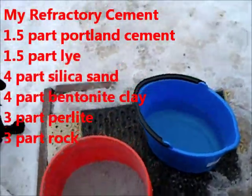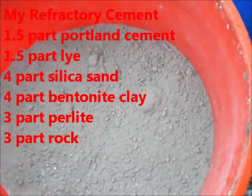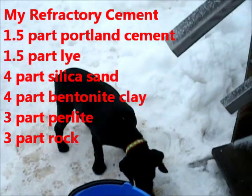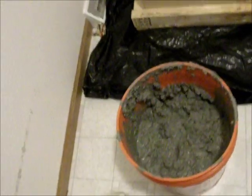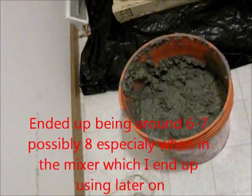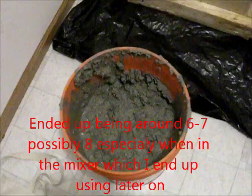I don't want the hassle of cleaning out my cement mixer, and right now it's about thirty degrees outside so I'm not going to do the cementing out here. I got my form and I'm going to bring it in the house. Here it is dry mixed - just mixed up with the lid on the bucket, that's what it looks like. I've got six quarts of water I'm going to add to see what my consistency is. I think I used five or six in the last batch, so we'll try six and see what happens. I think I used about five quarts of water for about a half bucket of mix, using a large spaghetti can to measure my parts.